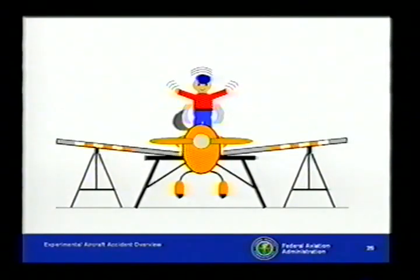This aircraft in the photo made almost six flights. On the fifth flight, the builder experienced a hard landing, the fuel started leaking, and he didn't have any inspection panels. So he climbed out of the aircraft and decided he needed to figure out why it was leaking. He had no way to inspect the structure around where the fuel tanks exist.